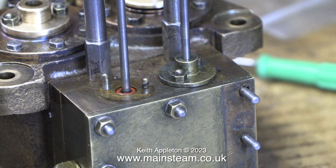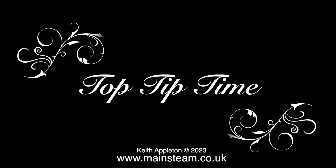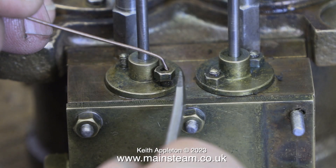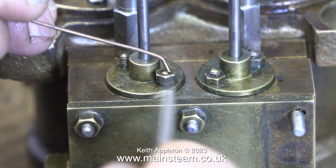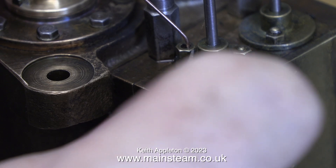This clip shows one of the gland covers removed and you can see the original O-ring in position. On the right hand side is the O-ring that was fitted and on the left hand side is a brand new one that I'm going to fit in its place. Top tip time: if you have a MIG welder, always snip off a few pieces of wire and keep them in your toolbox — they will prove very useful. Here I'm using a piece of MIG welding wire to keep the nut in place while I spin it into position with a screwdriver blade.